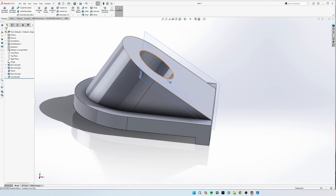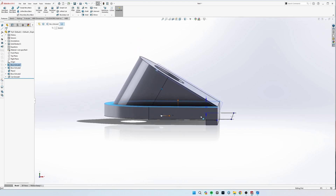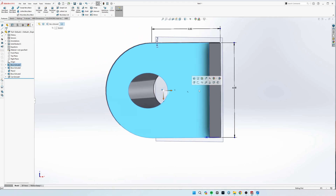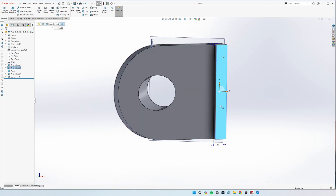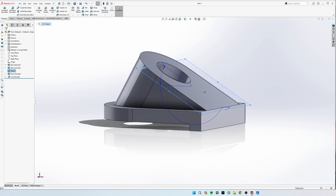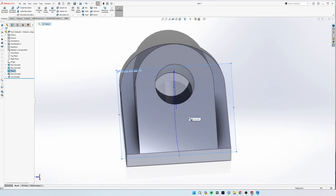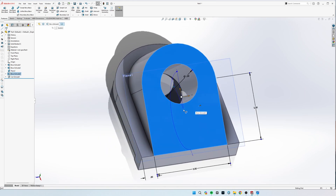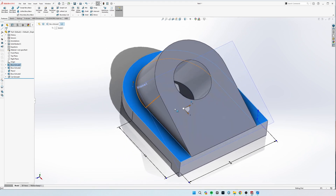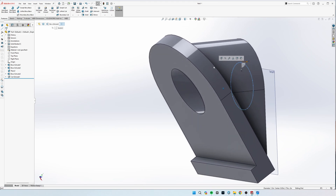I have the piece right here. We're going to build this piece first and then extrude it down. Then on this bottom face, we're going to build this rectangle and extrude it out. Then we're going to make this reference plane at 30 degrees off from the original plane, draw this face and extrude it up to here. And then lastly, draw this circle and extrude-cut it all the way through.